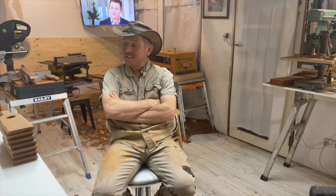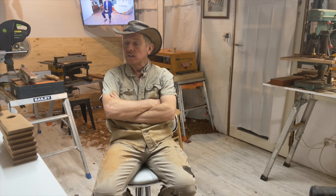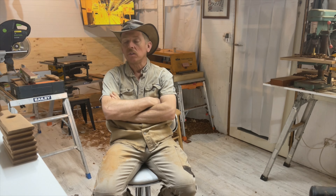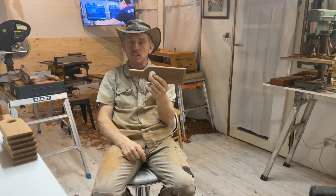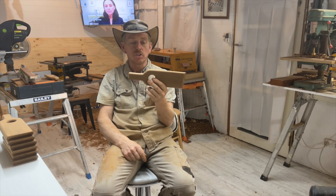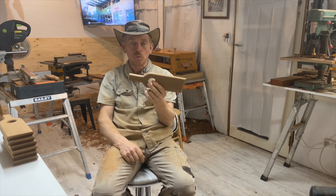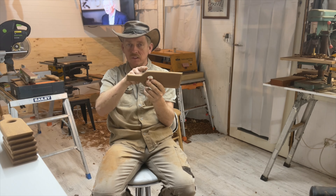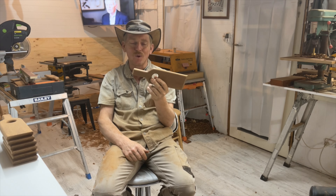That's the plan for tomorrow. I didn't get as far as I wanted today, but I had an incredibly late night last night and was still up early this morning. It takes a while to set up the process and work out how you're going to do things — just the simple thing of getting this cut as quick as possible without changing too many tools. You could do it with a jigsaw, a bandsaw, but if there's a way to do it with the circular saw that's much quicker. And this wood is really hard — doing the pine will be a walk in the park.